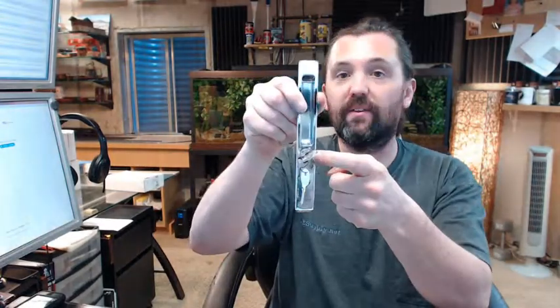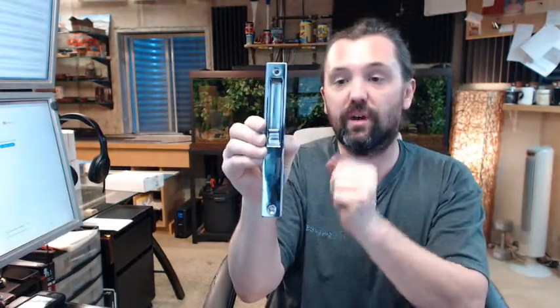Okay, so this part of the video is going to tell you how these things change. First of all, the 44870 is a no-latch version, meaning that you have to manually relock it. That's what that means. The 44873 is identical, except that there's no trim on the outside. There's no way to get in. On the 44873, all you can do is lock it and unlock it from the inside.